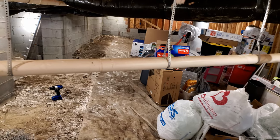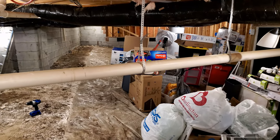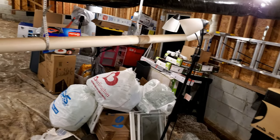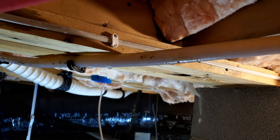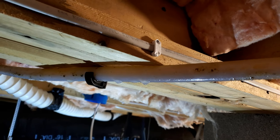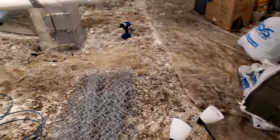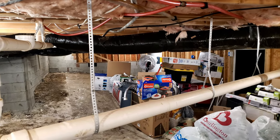I'll do a little bit of clean up first and maybe just a little reorganization. I'll just take this stuff out, put a new vapor barrier in, and hopefully do a better job than what it is now. The humidity is still up - you can see even the cold water tubes here, the white ones, are having condensation because the water inside is colder than what's in the crawl space. It's creating a little bit of moisture, but not a big deal. Hopefully the new vapor barrier will fix that.